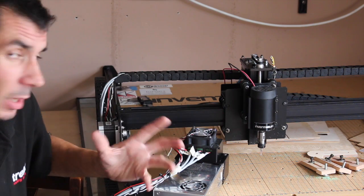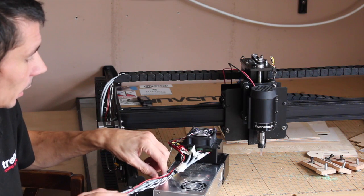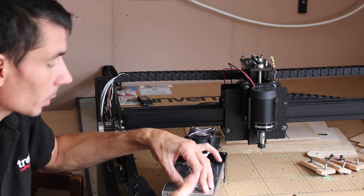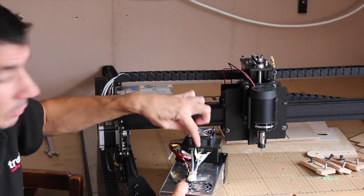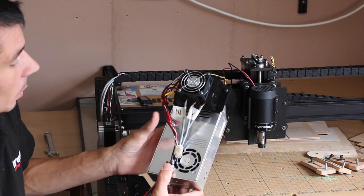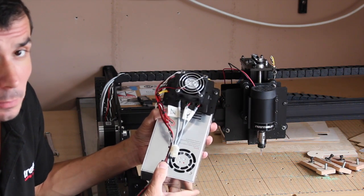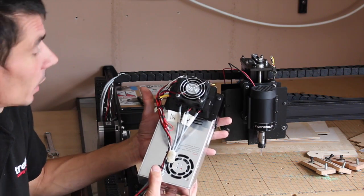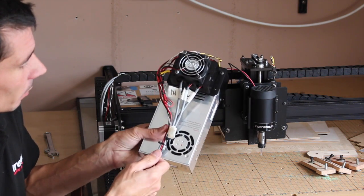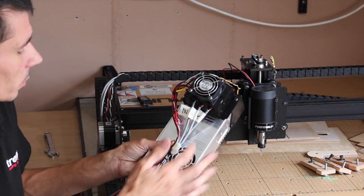And what it needs is a bit like a normal UK 3-pin plug. You get a little strap that goes over the cable to hold it where it goes into the plug, and that relieves the stress on these points. So I will be making some kind of case, and actually on the Inventables website somebody's already done that and left the plans on there, so you can just download those and carve a box. But they will definitely have some form of fixing this to the case to relieve the pressure on these.